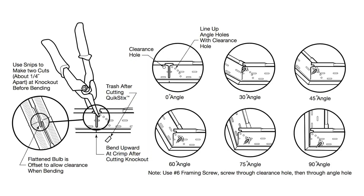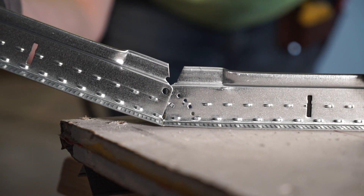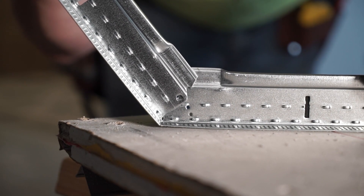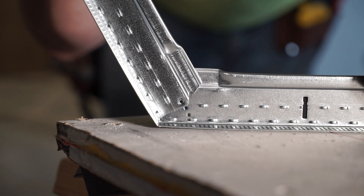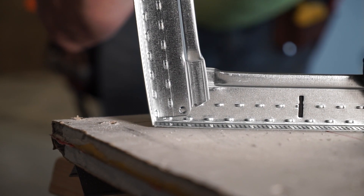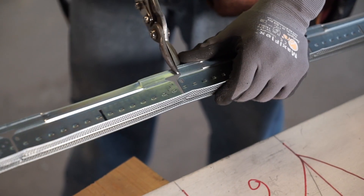For small 30, 45, 60, 75, or 90-degree soffits, Quick Stick soffit tees quickly bend to these five designated angles utilizing a protractor that was built into the tee. Simply lock the angle that you need with a sharp point screw and you're ready to hang your soffit.